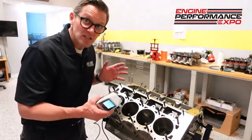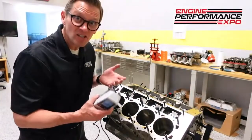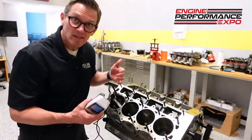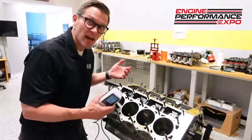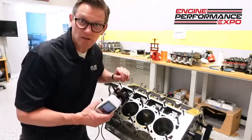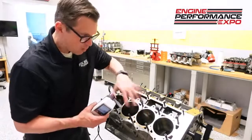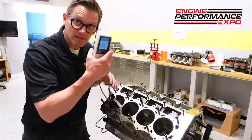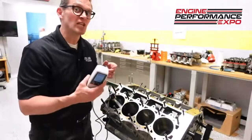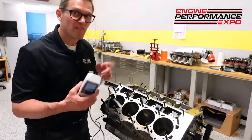The whole change is just the fact that there was some corrosion from the engine sitting — literally two months. Wish we had some of Gary and Steve's Fog-It when we had the engine on the dyno so we could have fogged it down. Definitely next time we're going to do that. But when you see some corrosion like that, if you can see it, the profilometer can definitely see it. It definitely changes the surface finish — something to keep in mind. Hope you enjoyed the video, thanks for watching.